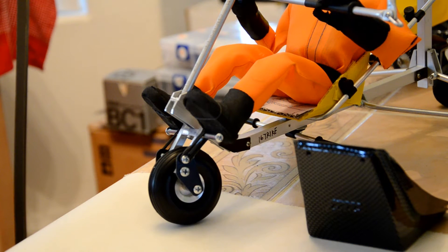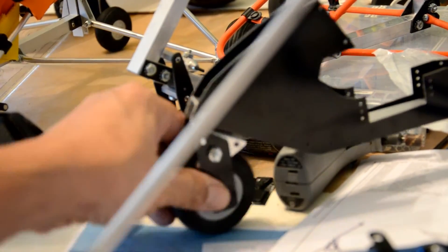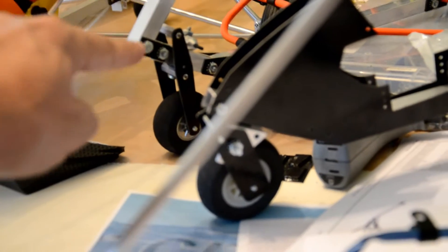These are my own springs selected for this application. It's very similar also to the MIA BBW Benson Brack Wallace autogyro that I did more than 10 years ago — same idea with the landing gear. The prototype in the back was along those lines, but this is a working mock-up that I'm refining. On the BBW I used straps that allow it to act as a spring without using coil springs, and on this one I'm doing the same thing because I know that system has worked really well in the past.